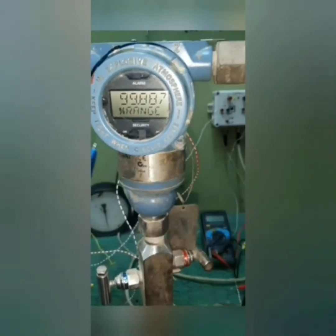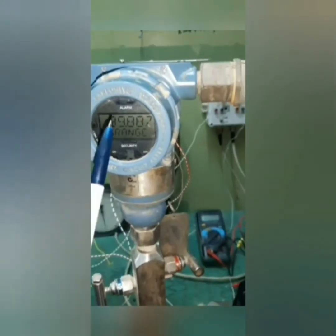That's done. The last step after the zero trim and the upper trim is to verify the calibration readings by increasing and decreasing the applied pressure. From zero to 250 bar when increasing, I should reach these values shown by equal percentage values, and when decreasing from 250 to zero I will get the corresponding readings.